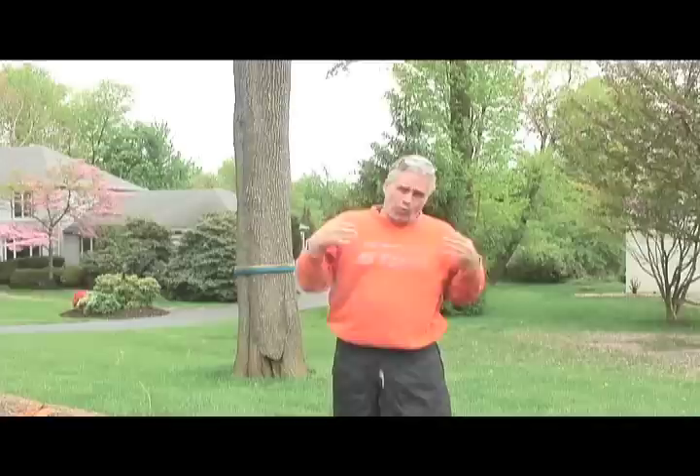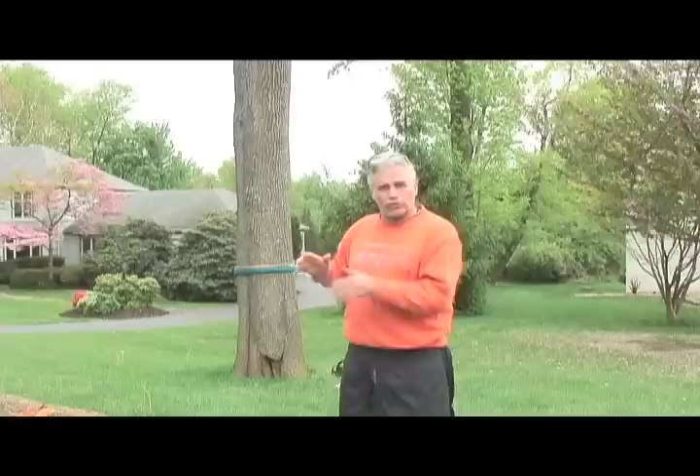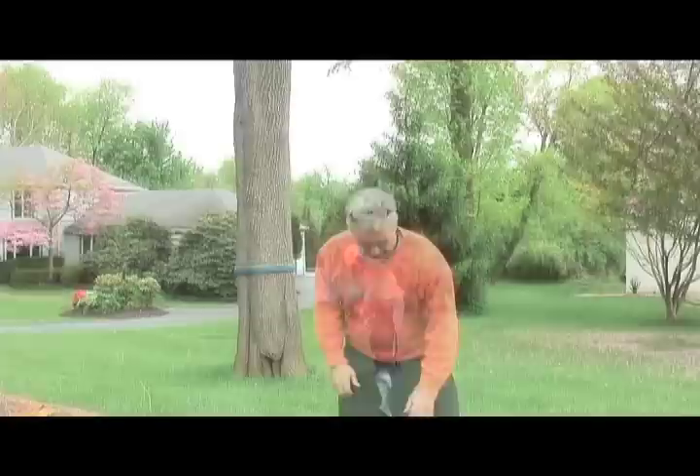What causes barber chair is when the forward force on the tree is stronger than the structural integrity of the trunk, causing it to split vertically before the hinge is fully formed. If the hinge is too wide, thick, or strong, the forward pulling force will tend to split the trunk vertically. This occurs naturally in forward-leaning trees, which have to be cut in a special way to prevent barber chair. It can also occur from a poorly formed notch with a bypass in the two cuts, or when the pulling force is too strong. This barber chair is caused because the hinge is actually stronger than the vertical grain of the trunk, so the forward force causes the trunk to split rather than the hinge to fail. Today we're actually going to induce the barber chair — just a back cut about two-thirds of the way through, no notch — then step away, with no chance of anybody being hurt, making it a great scenario to experiment.